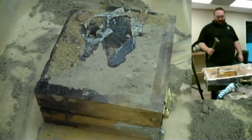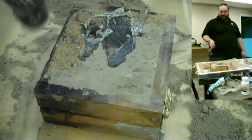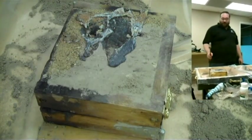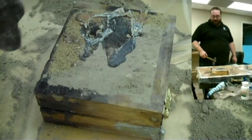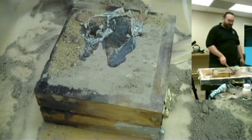When we did this mold, we made a mistake. You are supposed to make sure that when you assemble these things the hinges and the snaps line up, so that you can take it apart before you pour it. In this case we didn't do that, so I could not take the mold apart. I did not want to recast the mold, so I just cast in it. When you do that, the molten metal will cause some damage to the frames — not a great deal, but you can see it has happened several times before.